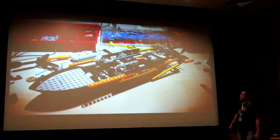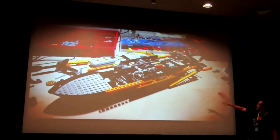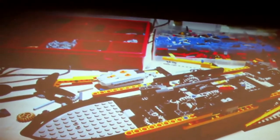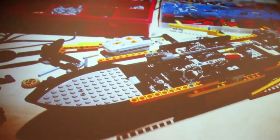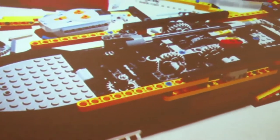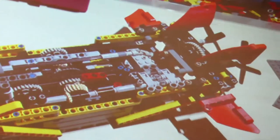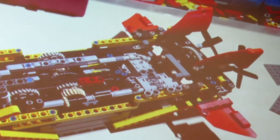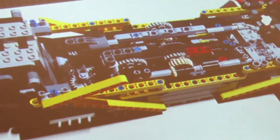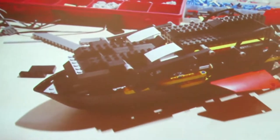This is the prototype I was building a while ago. Here you can see already what I've shown you with the extra gearboxes, because one motor would control the distribution gearbox, and the other would be for the drive. The distribution gearbox would swing one set of control surfaces in one direction and the other direction would control the other. So we had some kind of splitter and a ratchet and other kind of mechanical things, as you can see here in the tail.